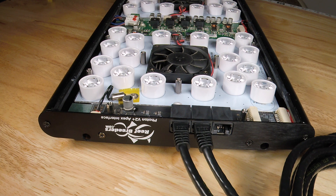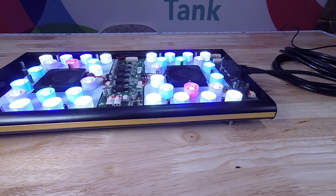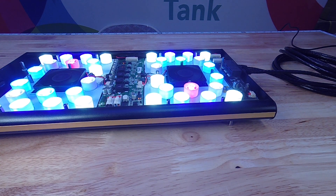Now that all the VDM signals have been set to OFF, we're going to go ahead and plug in the light. Remember to first plug in the DC power supply to the light, then plug in the DC power supply to the wall. When first plugged in, your light will go through an initialization phase where it goes through each channel. The fans will be on, and then all channels will power up to full power, then slowly ramp down.